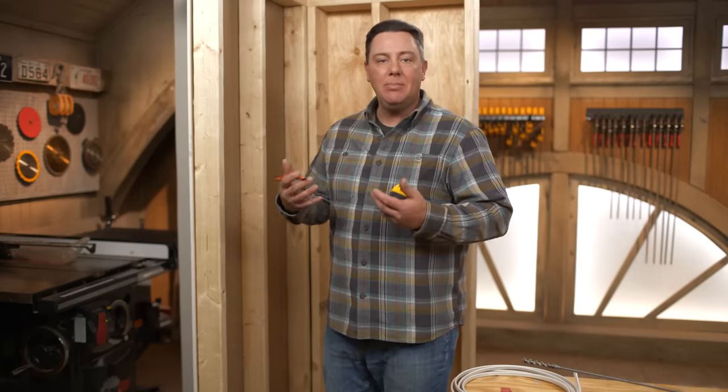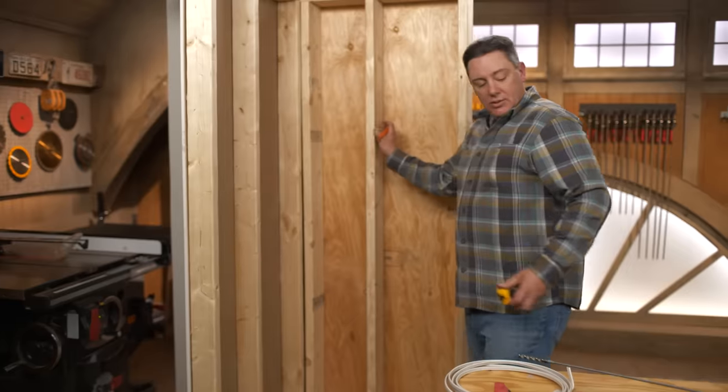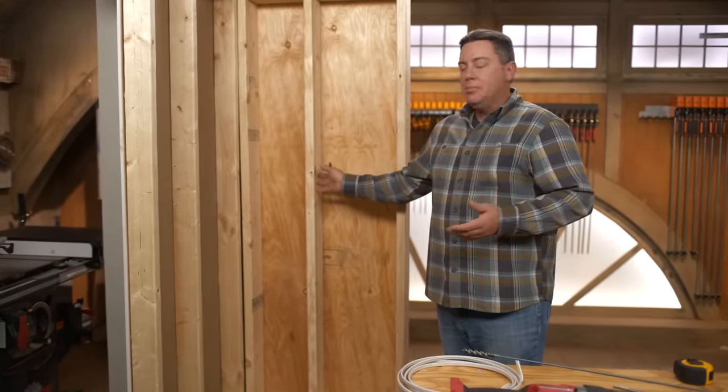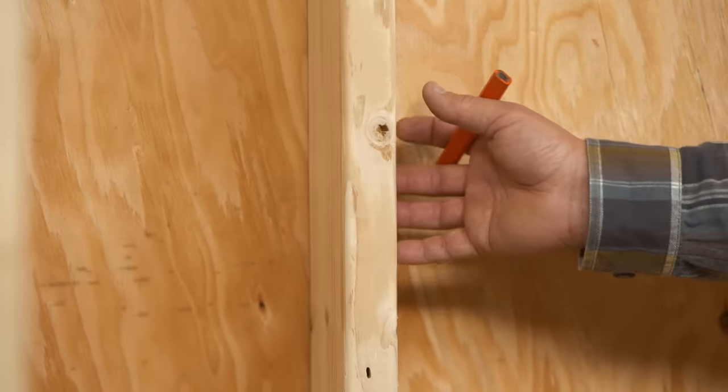The best practice is to step the bit size down — maybe drop to a three-quarter-inch bit — so you don't have to measure every single stud to find the exact center; close enough with your eyeball works. When it comes to a two-by-six stud, we can still use that same bit or go up to a one-inch bit, and we know roughly where the middle is going to be. We have plenty of clearance, and it's easier to drill.